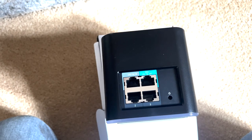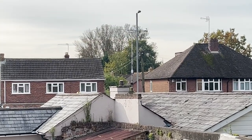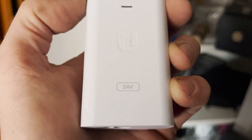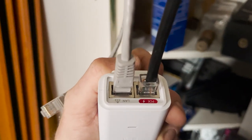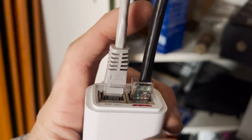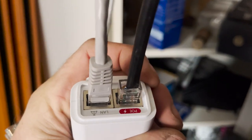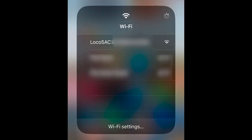Here's the other end, and we're trying to shoot the signal back over to where we were previously — you can just see it over there in the distance. This is a 24-volt PoE injector we're using to power the access point — it has to be 24 volt. You can see the PoE output and the LAN output. This cable goes to the access point and this cable goes to our switch.